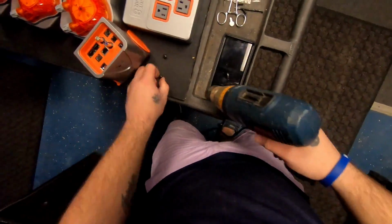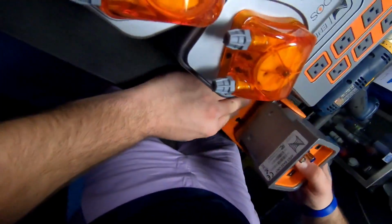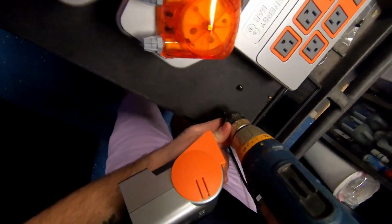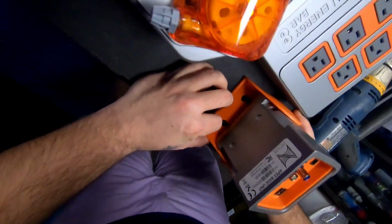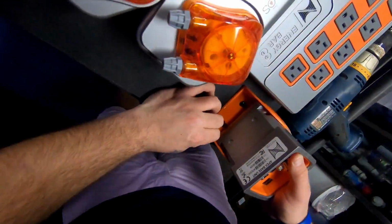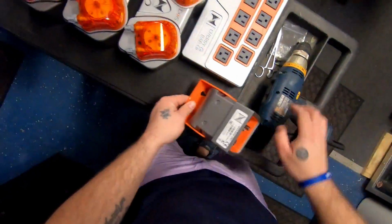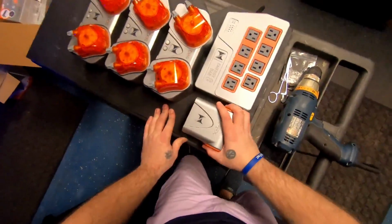All of the components on the board are wired around to the back, and then I have mounting zip ties that hold all of the wiring back there nice and separated. So the wires are not all jammed together and twirled around. If you were to pull the board out from the back of the stand, you would be able to easily trace one wire, yank it, and replace it.